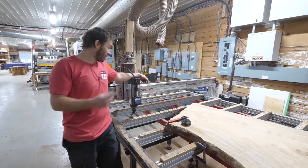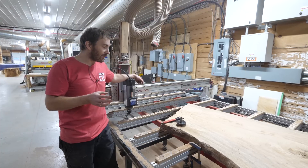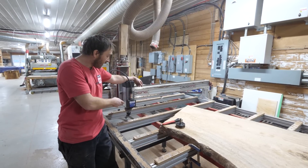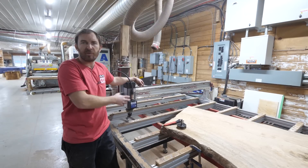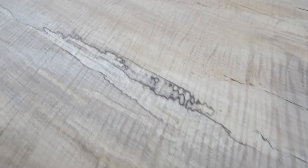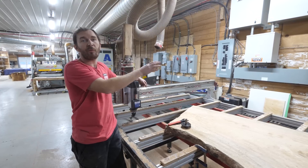First impressions — this spindle is badass. Just the sound of it cutting, you can definitely tell there's way more power. Not only that, I think it definitely runs more true. The other one you could almost hear a little bit of vibration to it. We're using the exact same cutter, but probably better quality collet and nut as well — just overall better quality in the entire spindle. The finish is amazing, and we just quickly squared this thing up. We haven't trammed it totally perfectly yet, but I'm insanely impressed. I can turn it on and off from the computer and control the RPM — I couldn't do that with my old one.